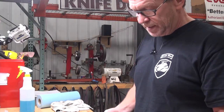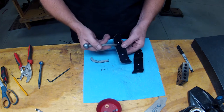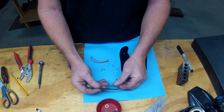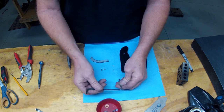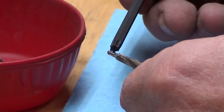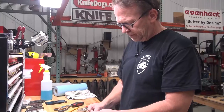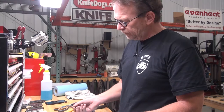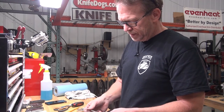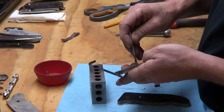In the meantime, I've taken these scales and I put a countersink in there using a countersink tool. This is actually a number 2 socket cap screw countersink. So the outer diameter is about 159. The pilot is around 3/32, which happens to fit a perfect through hole. So the process is just put it in there, and using these scales, it all lined up where I could just go flat like that, and it countersank perfectly for us.